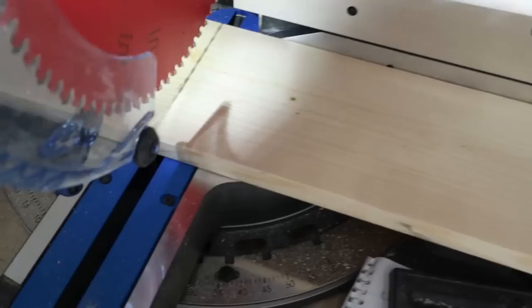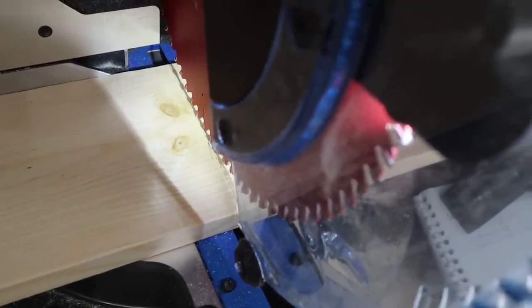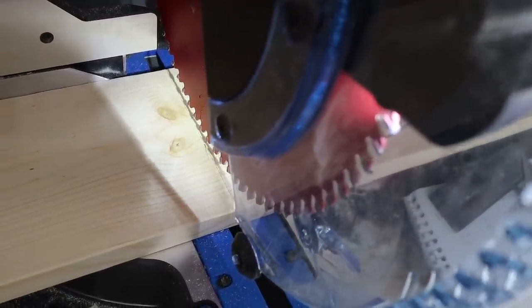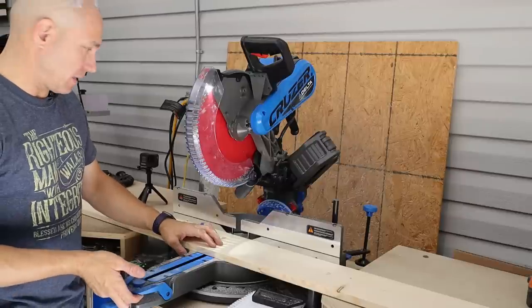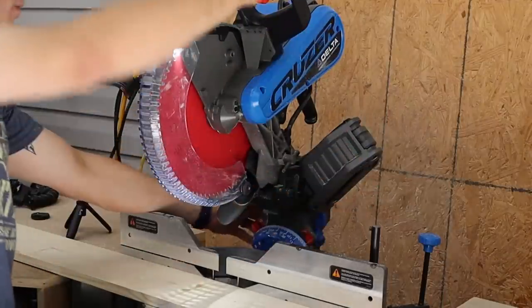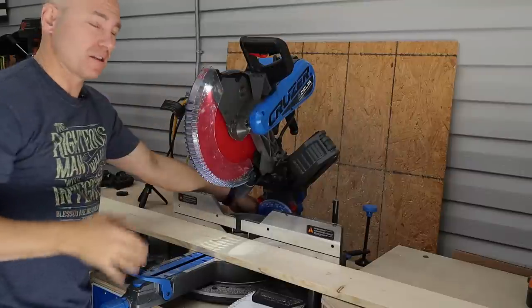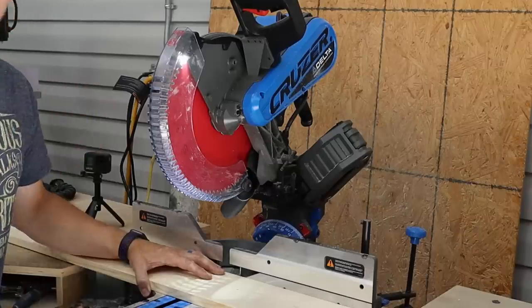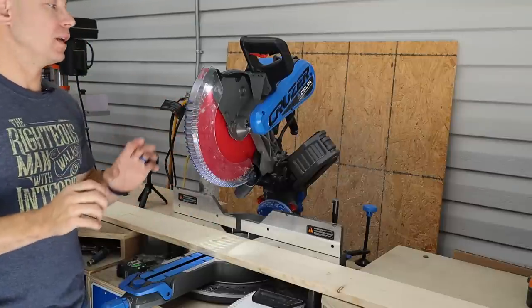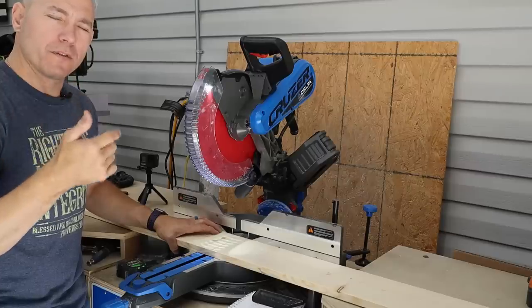It features the shadow line cut — it puts a shadow on your stock when you come down, and it is really accurate; you can see exactly where your blade is gonna be. Notice the teeth are wider than the blade thickness so you can see where the teeth are. My DeWalt did not have that feature, and it can be turned on or off with a toggle switch. For bevelers, you can flip a switch in the back on either side to remove the positive stop and bevel up to 47 degrees both ways. You can cut miters up to 60 degrees to the right and 50 degrees to the left. It's a really, really nice saw. Click the links in the description to Home Depot or Amazon — sometimes one has better pricing. A full review is coming in a few weeks.